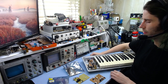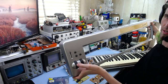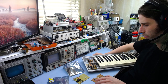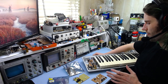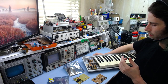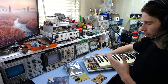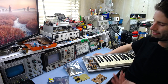It seems to work fairly well. I didn't hook up any of the controls on the front — it's got volume, some buttons, a pitch wheel, and stuff like that, all plugging in with standard plugs. I was purely testing the keys in this prototype version. He did implement a little XY joystick that could be used for replacing two of the wheels electronically. He also implements a few buttons, a sustain pedal you can plug into the jack, and various other things. I basically took his schematic and wired up everything I could. The only thing not connected was the LEDs for each of the buttons.